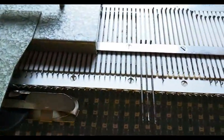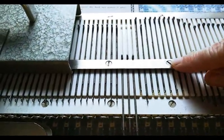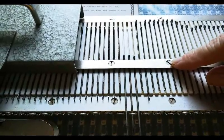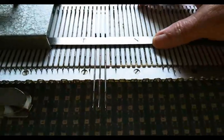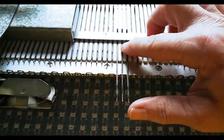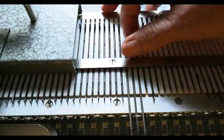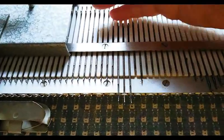I think its problems are at least threefold: there may be a little bend here that there's not supposed to be, and Jack's going to check that for me. Underneath here there is supposed to be a sponge strip of some sort, and at this point it is probably sponge dust, not a sponge strip. Also, the needles — somebody's worked on them a little bit in the past — had some rust on them and it's not completely gone, so they're not real smooth sliders.